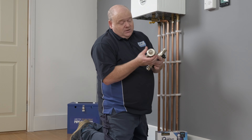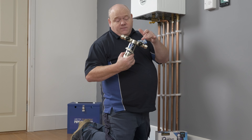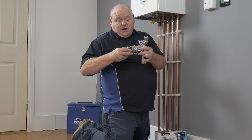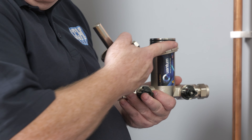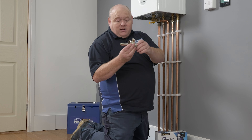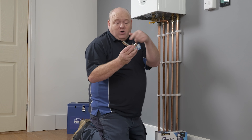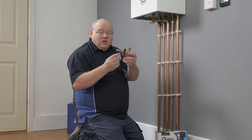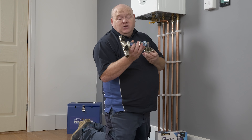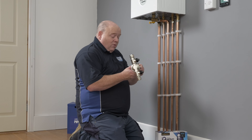With the Quantum filter, it has valves on it, so if you're going to strip it down when it's on the system, you turn the valves off and take that part out. It has three o-rings — two on there and one inside — and a big magnet inside. As water goes around the system, the magnetite sticks onto the magnet. To clean it, just turn the valves off, take it apart, and clean it out easily.